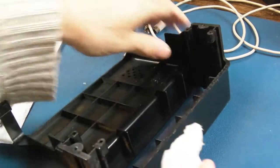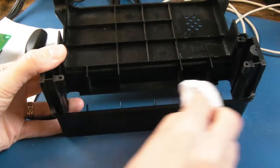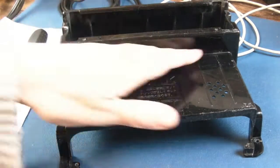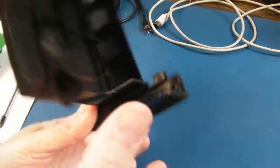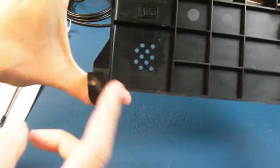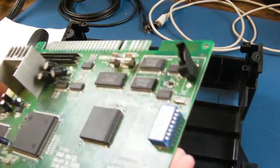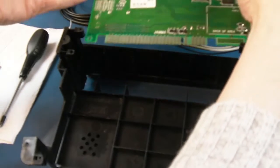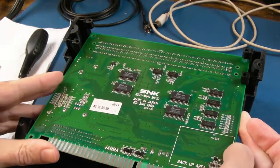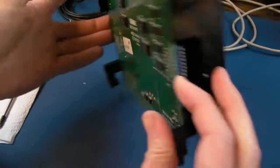Let's clean the underside of the shell — it's a bit dirty there, but it's coming out pretty clean. In terms of getting the board in: because of this heatsink, you can't slide it in from the front or back directly. You have to go in at an angle — get the back end in first and then slide it to the front. Then you flip it upside down and get the screws into the holes.